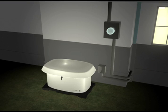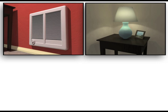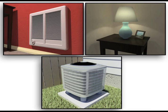Load management is a key feature of Cummins Onan residential generators. It allows you to use a smaller, less expensive generator. With load management, you can run the essentials like heating and lighting, and it also automatically manages power to other selected large appliances.